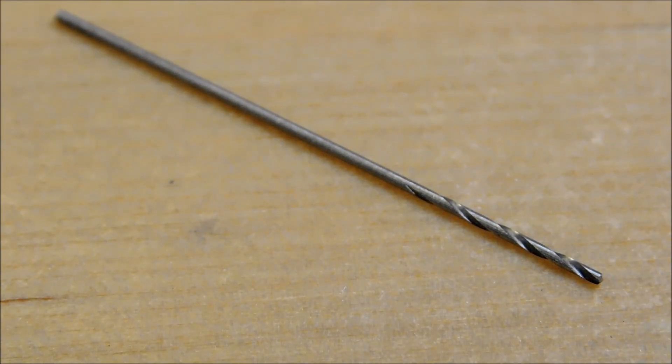Okay guys, this is the drill that I'm going to use for today's demonstration. Just to put it in perspective, we're going to push this into a piece of stainless steel because that's about the worst material you can think of for a small wire drill. I mean you could get into an exotic Hastelloy or Inconel or one of those Monel type nightmares, but just for sake of this demonstration, let's push this into a piece of stainless steel.